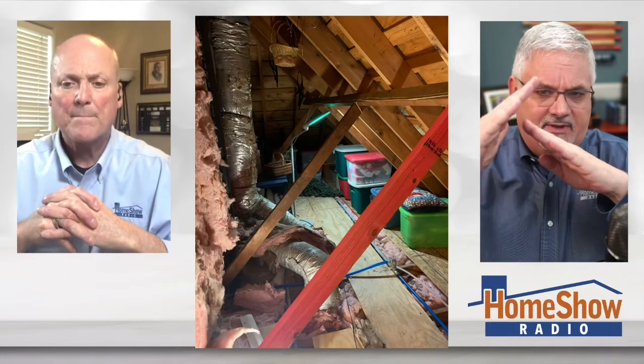Let me bring it back up for one more second. I noticed those are at a 45-degree angle coming off. I would think that would be the optimal angle for the job it's trying to do. Will it still perform that job at a lower or higher angle? Yeah, you'll just have to put more of them and brace it a little differently with someone who's experienced. You just need something to hold that strong back up. It's always nice to have it at a 90-degree angle, but you'll probably have to put a few more in. I'd have to look at the span — all I'm seeing is a small section. But you can re-brace a rafter system all different kinds of ways.